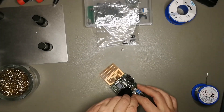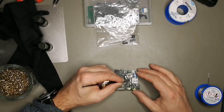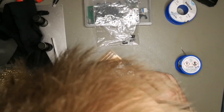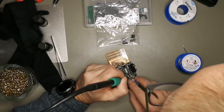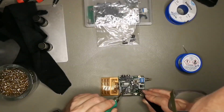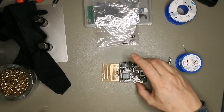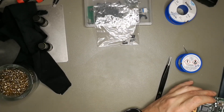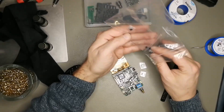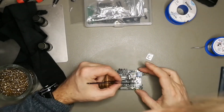As you can see, I'm just working my way through the capacitors. Luckily there aren't so many, but there are tiny resistors and capacitors around them so you have to be a bit careful. Use a fine enough tip, but not too fine that you can't get heat onto the board, and make sure you're not accidentally nudging some resistor or capacitor off.